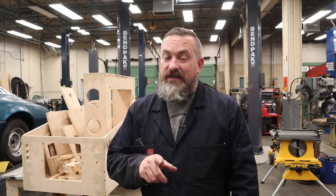Now, one other thing I would add about the sandpaper is people are very prone to rush through to get to the end grit, because it's a lot of work and we just want to get to the end and sand. However, if you have deep scratches, maybe caused by the original 60 or 80 grit that you were using, do not expect to go right to 400 grit and just sand and sand until it comes out. The general process is you go through the first grits and leave sanding marks that are only caused by that 80 grit, and then you switch up to the next sandpaper grit, and you only leave what's caused by the 120 or 150, and go slowly through the grits until you finally get to that 400 grit, and the surface is completely 400 grit and no other scratches. So don't rush that process, otherwise you're going to have all these deep gouges and scratches visible when you do your final sanding.